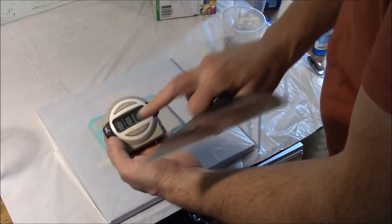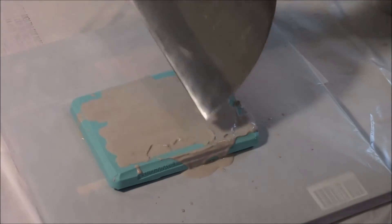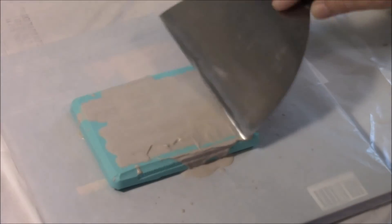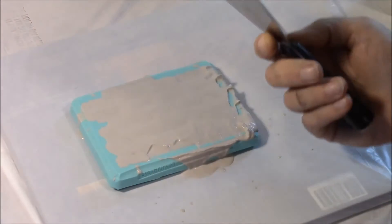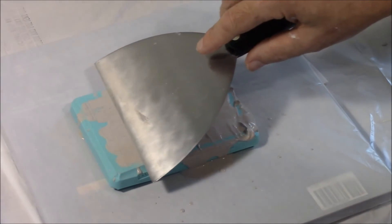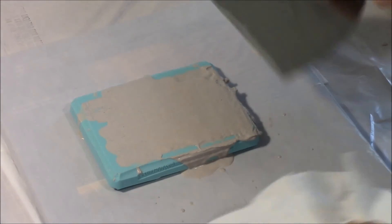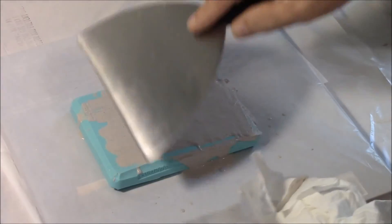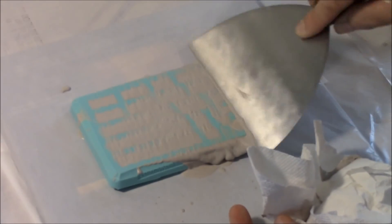Set a timer for 2 to 5 minutes. This mold has set for 3 minutes and you can see it thickened up — it's more like soft margarine now. Take a 6-inch putty knife used for sheetrock, lay it at about a 45-degree angle, and with not much pressure gently scrape over the top. You can wipe off the excess with a paper towel. If it's hardened a bit, use a zigzag motion to clean off the top and break up any plaster that's a little too thick.